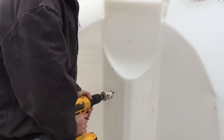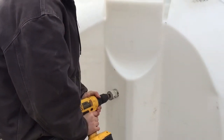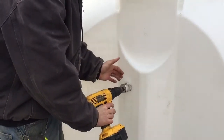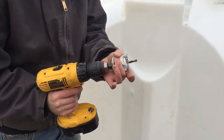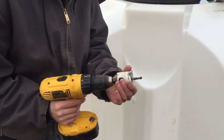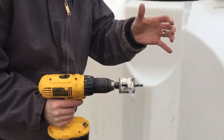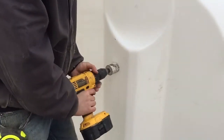When you're drilling, you want to make sure that your bit is very tight inside the hole saw and that the arbor is on tight. You don't want any wobble in your hole saw, or else that will enlarge the hole and throw the dimensions off.